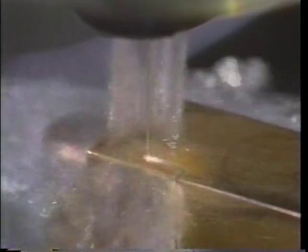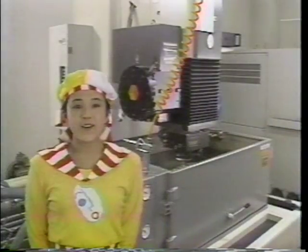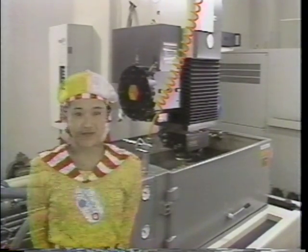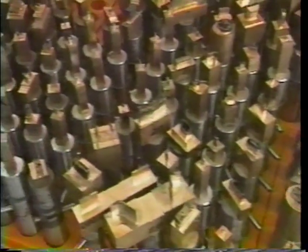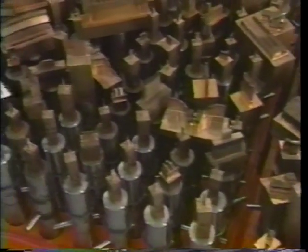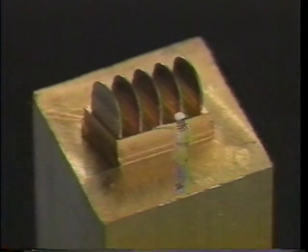According to the data stored in the controller, work pieces are cut by the electric energy discharged from the wire. This is an electric discharge machine. Instead of using wire like the wire EDM, the EDM uses electrodes and electrical arcs to form the workpiece. You can see an electric arc at the tip of the electrode. Dies are machined into a shape opposite that of the electrode. These various electrodes are used to mill complicated three-dimensional shapes.